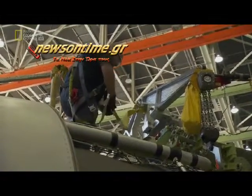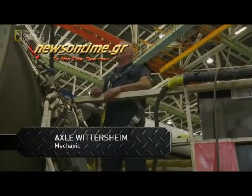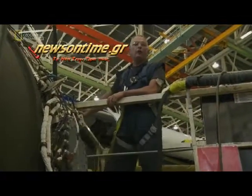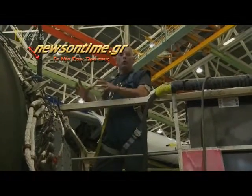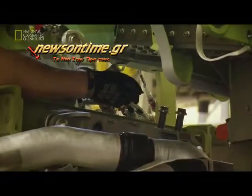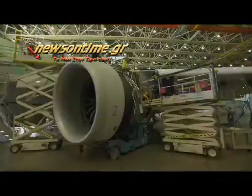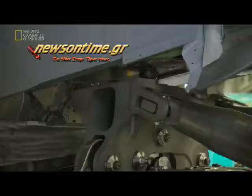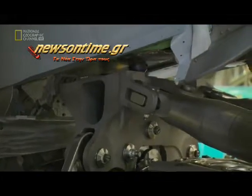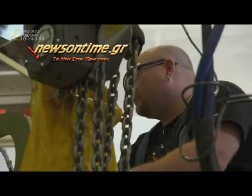Harness up for safety. We're about 12 inches away. We're going to pull the bolts from the front fitting. There's a pin up front that lines up the forward mount, so we lube that up with anti-seize. We'll come up another 6 inches, make sure everything is clear. Then we'll come up the last 6 inches and then put all 4 bolts in. Very close tolerance, within a 1,000th of an inch. Come on up.